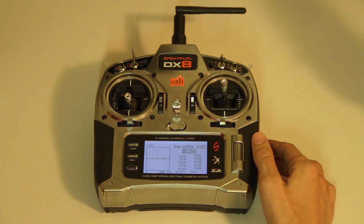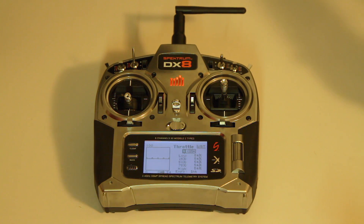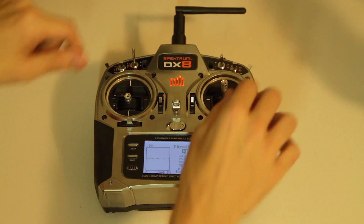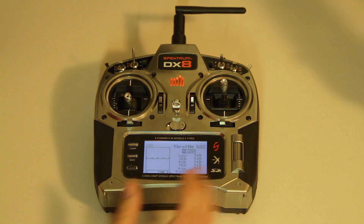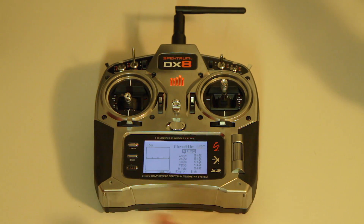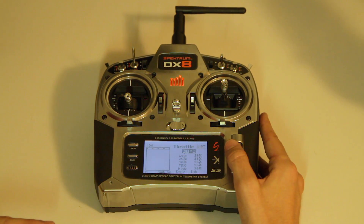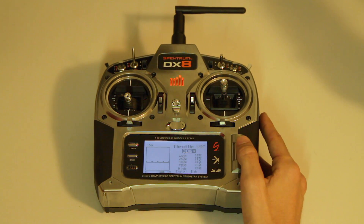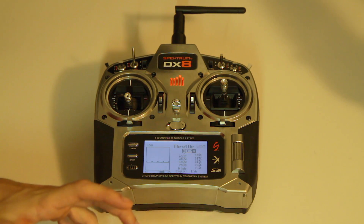Here I have it set up — on N I have set it to 54. You have to check with your Naza M software whether this value will trigger the corresponding flight mode, because the calibration you do will make those values vary. Try 53, 54, or 55 — that should do the trick. So this is attitude mode, this is manual mode, this is GPS mode, and this is return to home or failsafe.